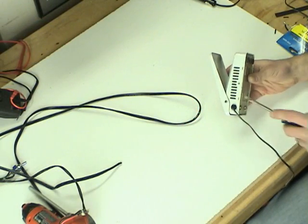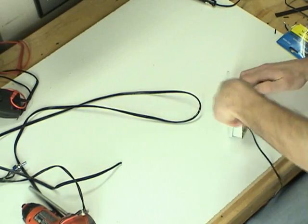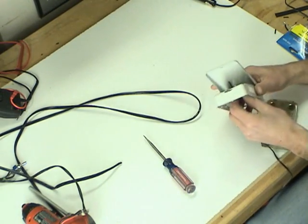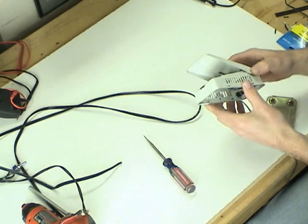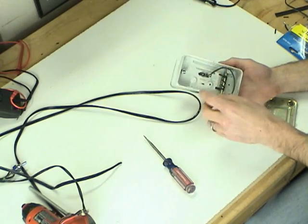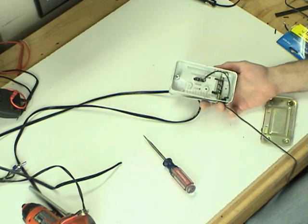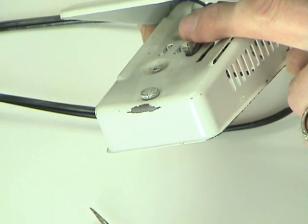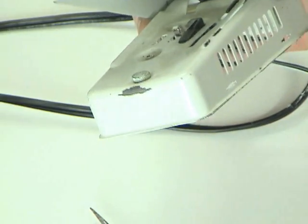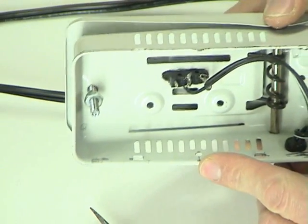Now I'd like to talk about the foot pedal. This particular pedal was actually from a sewing machine, and it had a potentiometer in there — it was a speed controller for the sewing machine. What I did was take out the guts of what was in the pedal and mount a contact switch. It's a spring-loaded contact switch that when you press on the pedal, it completes the circuit. The power comes in one side and gets interrupted by the switch, and when the switch is pushed down, it lets the power flow through and back out the other wire. If you can find a housing like this, you just need to mount one of these micro switches inside. Those micro switches are available from Radio Shack or any electronic supply warehouse — they're simple spring-loaded switches with an in and an out. The switch interrupts the power, and when contact is made, it completes the circuit.